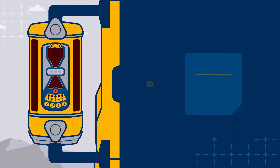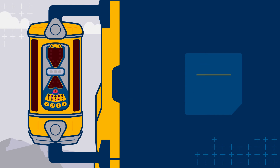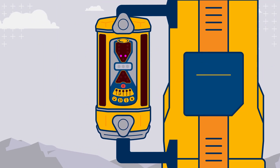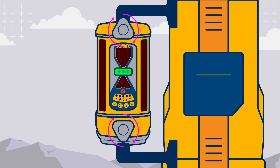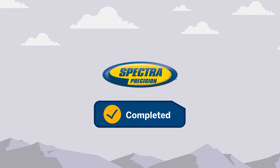Select the fine accuracy or narrowest on-grade width. Move the receiver up or down until the green on-grade LEDs are solid. Turn the knobs clockwise to tighten the clamps and ensure a green on-grade is still being indicated.